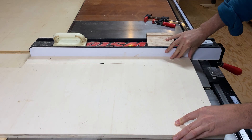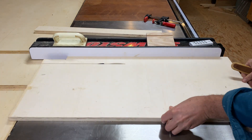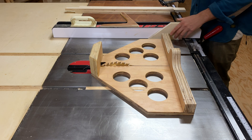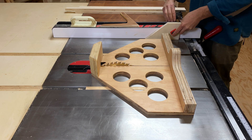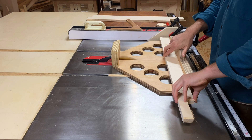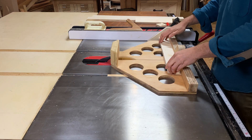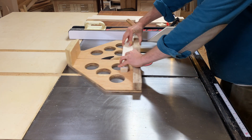I'm cutting the arms out of some leftover 11-layer plywood from a miter saw station I recently took apart. It's really good for something like these arms which need a lot of strength and won't twist at all. Then I set up a stop block on the fence of the table saw to cut them all down to length. That stop block is made of three-quarter-inch plywood and the fence is just three-quarters of an inch further than I'd normally need. You just have to make sure your stop block and blade are never touching the wood at the same time — the wood needs to be clear of the stop block before it gets to the blade.